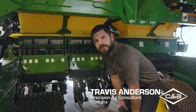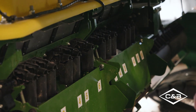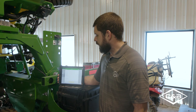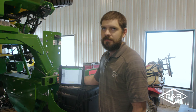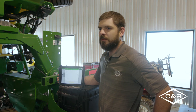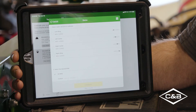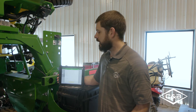One of the big changes with this new N500C Series is the ease of access to the meters. As you can see, we've got four ranks here, one per electric motor, and each one of those electric motors functions as a section for section control. This particular model has four seven-and-a-half foot sections. The thing I really like about this drill is the mobile feature — you can download an app called Seed Plus onto your iPad and run all of the calibration procedures from the back of the machine, rather than constantly going back and forth between the machine cab and the rear to start procedures and enter values.